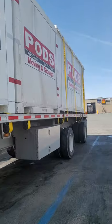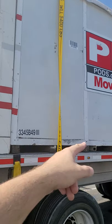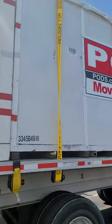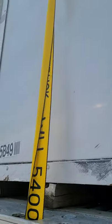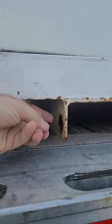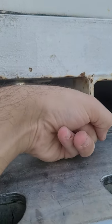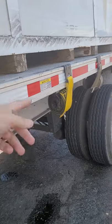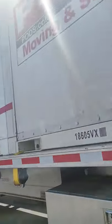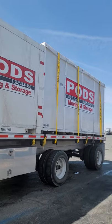For the most part this load is pretty secured as is, and we just put the strap just in case. Larger containers and some containers don't have lift points — this one has a lift point, this one doesn't. They want you to twist the straps so they don't flap. There are chain hooks on the bottom as well if you want to tie down. You can put the chain here, drop it down to the other one, and use a binder to secure the larger ones.